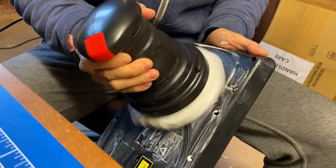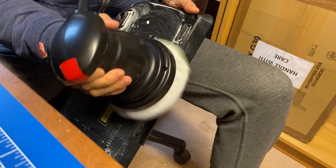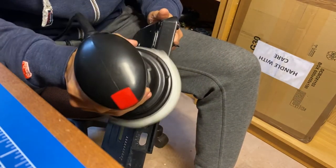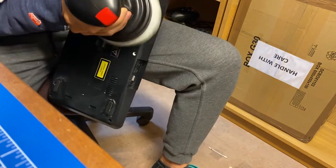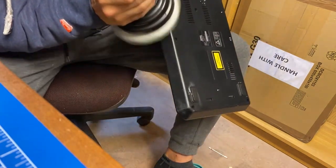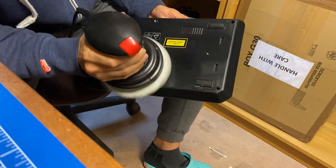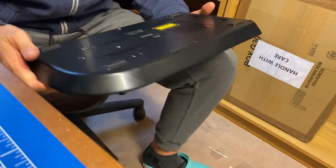It's so good to see those areas lighten up again without all that plastic dust. For now, I'm going to use a harder pad on the polisher to get rid of the scratches even more. It's a time-consuming process. You have to go over every surface, every part of the shell. Already after this, the shell looks miles better.